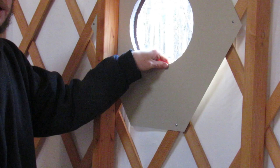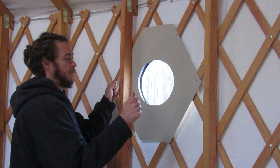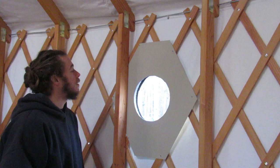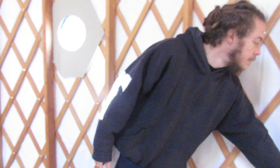I put this down on a flat piece of wood that I didn't care about drilling into and drilled into the flashing through it and then reversed the screw, came back, flipped it over, and then put it in the correct way. All the barbs are also on the back side since I drilled through the opposite direction. And we're done with the inside flashing. So on to the outside flashing. We'll get that done and we'll be back with you in a minute.